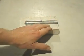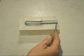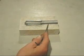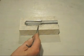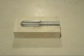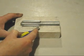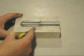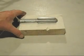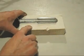It's still a bit rough, but I might have to smooth that out. The important thing to note is you'll see my parting line there, and then it disappears around here and around here. These edges need a tiny bit to take off to make sure that it doesn't stick when I do the other half. And this is how we trim the edges. All the surfaces have been cleaned up and the parting lines.